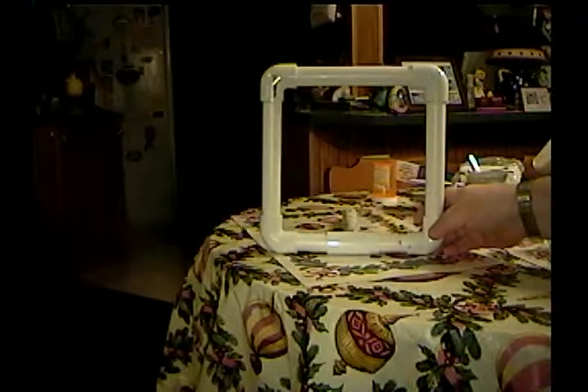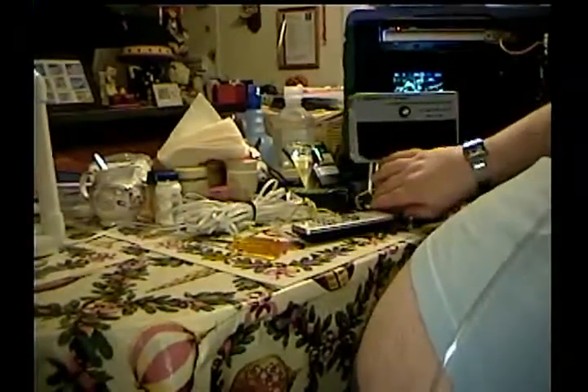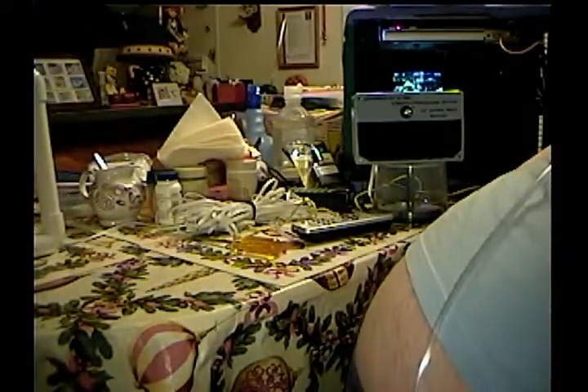The tilt function is pretty effective and helps eliminate quite a bit of hum. First we take the tilt to almost completely vertical and do the horizontal bearing angle — that's about as quiet as it gets in that direction. Then we adjust the tilt. When the receiver is that close it can pick up some interference from its own power transformer, but we're dialing it in. And look there — we just caught a tweak!